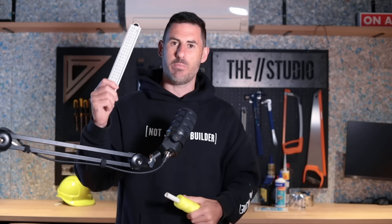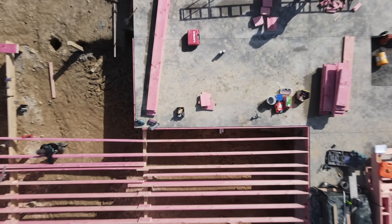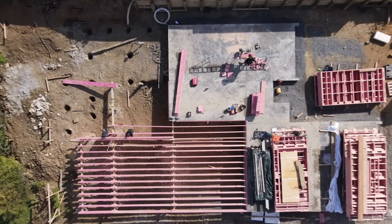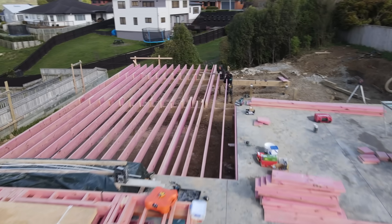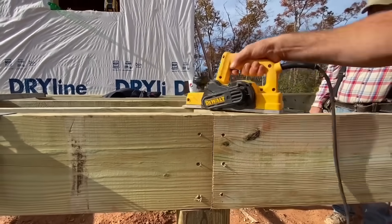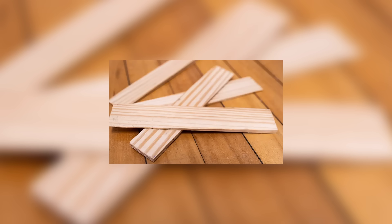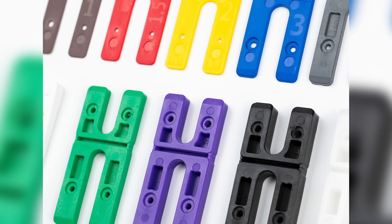Now you're ready to install joists. The first thing to do is make sure your heights are working — double check with your lines and measurements at every step so the final layer just goes down and lines up perfectly. If your height is a little bit off, you can adjust under your joists. You can plane or chisel a couple of mils out of the top of the bearer or the joist, create a timber shim, or use packers — including pre-made packers or DPC, damp proof course.